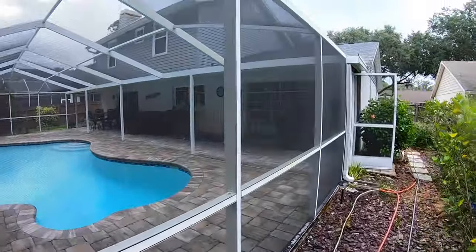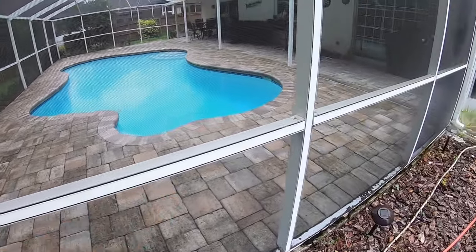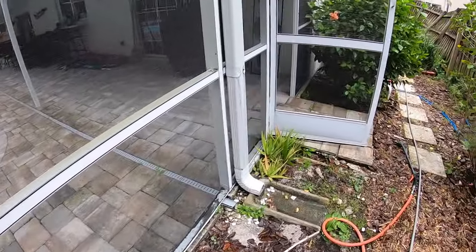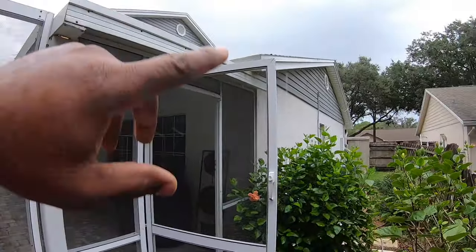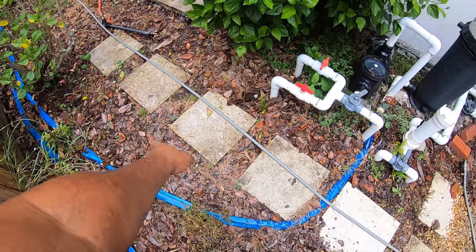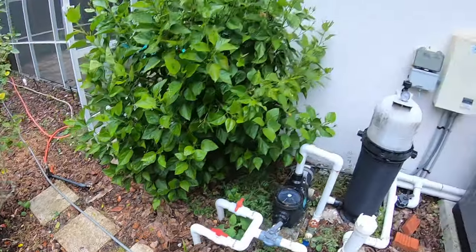But yeah, we're gonna rinse this up, man. Hit this pool. This one right here isn't as bad as the last one. I'm gonna use a 3% mix on my proportioner. Pre-treat the deck with the same mix and the driveway with the same mix. We're gonna do the pool screen first, then move on to the house wash, and then we're gonna do the driveway. I sprayed these with my mix already just to test it out, and you can tell already that it's reacting to the algae.